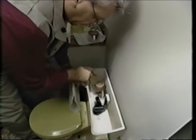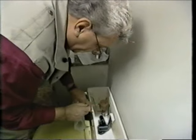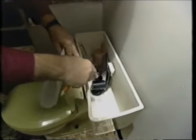I've already got the bottom of the tank insulated with the foam — very easy, it wasn't that difficult at all. We had one cut across between the flush valve and the filler valve, and then simply cut out around the filler valve and the flush flapper. Now that's all in place. What we want to do next is cut the foam for the ends, the back, and the front.